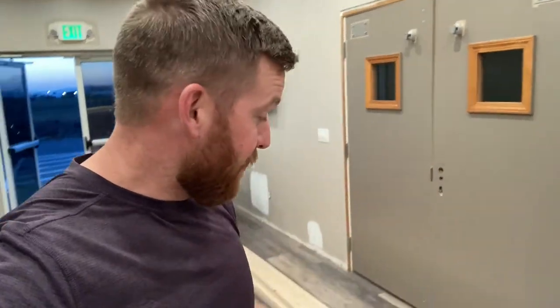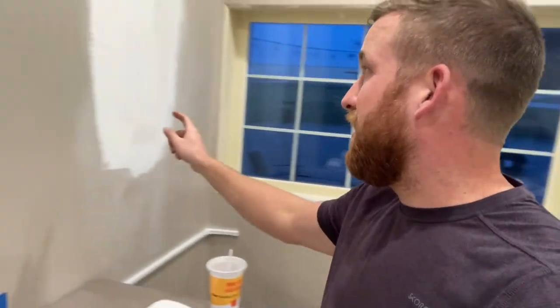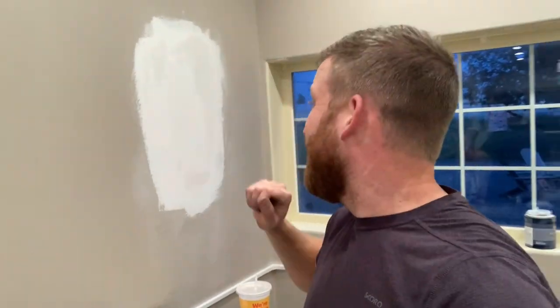So tomorrow, we're probably gonna do some more painting on the doors. We're gonna do some trim work, and since we picked the stain color, we can actually start staining the trim, which is gonna go around the perimeter. And then this mud is actually dry right now. I did a little bit of sanding on that one down there. This one was still wet yesterday when I left, so I hadn't sanded it yet. But we'll texture those and get those painted, and the room will look so much more finished without those big white spots all the way up and down them.